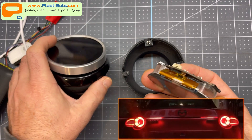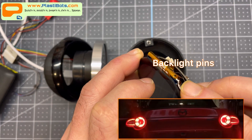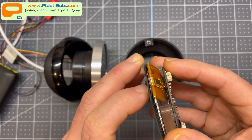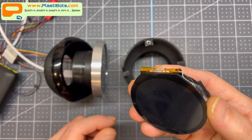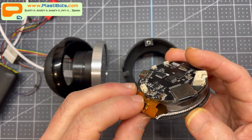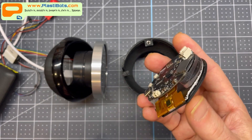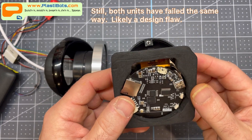The only issue is I've had two of them now and both have failed. The failure is where the ribbon cable meets the display unit — I think it's coming separated from the main board, specifically the driver for the LED backlight. Everything else works great but the backlight fails. They've been kind enough to send replacements, but I think there's a design flaw with too much stretch on that ribbon cable. That said, I was doing a lot of testing over months with it exposed, so I've since been inserting it into the foam unit they provide to stop that area from getting abused.